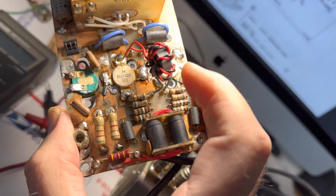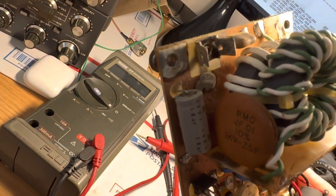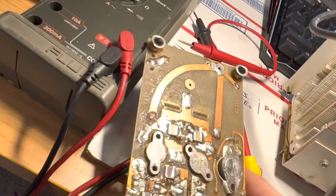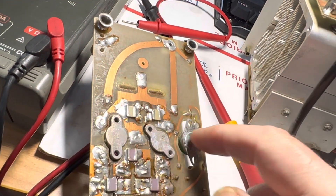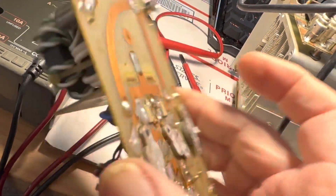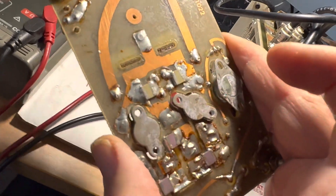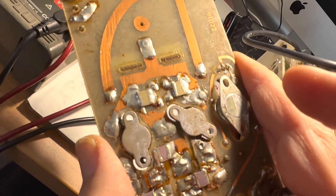I found that the resistance on the other board that works is 7.5K going in through the power pin. Power comes in, lands here, lands here, goes through those blue toroids. I couldn't find anything that would give these less resistance except that the devices themselves are blown up. So I guess I'll replace those and see how it goes.